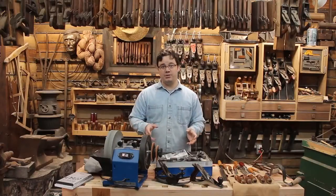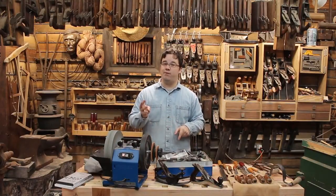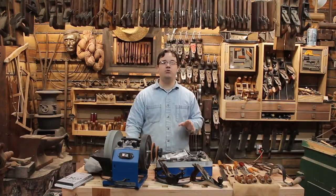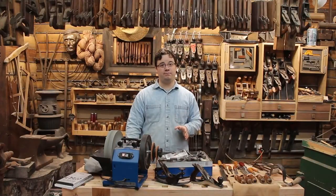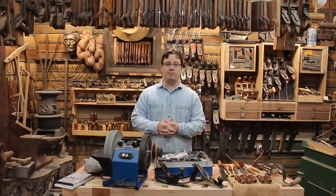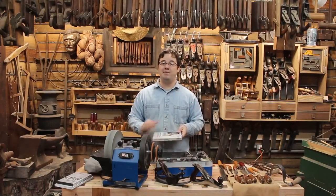You know what that means — get the family together for movie night. I've tried a lot of sharpening jigs, and I'm not going to tell you this is the only way to get a good edge. But after using it for a while, I really think this is the best way for three reasons. First, the jigs make sharpening so precise that each time you re-sharpen an edge, you're only removing the tiniest fraction of steel — that adds up to a lot faster sharpening and a lot longer tool life. Second, the slow-speed water-cooled stone and leather stropping wheels produce a way sharper edge than a bench grinder with no chance of overheating. And finally, the virtual sharpening class on DVD has already made me a better turner.